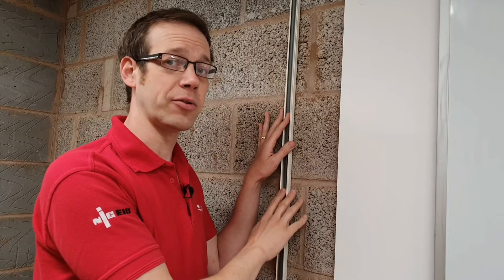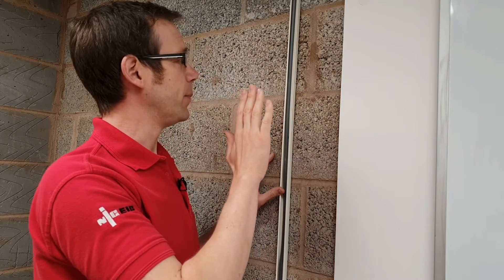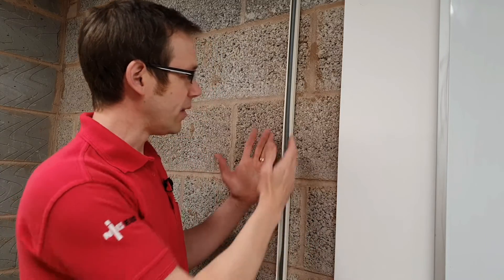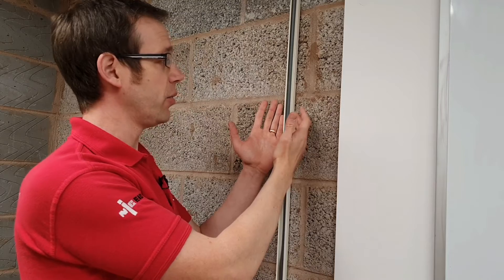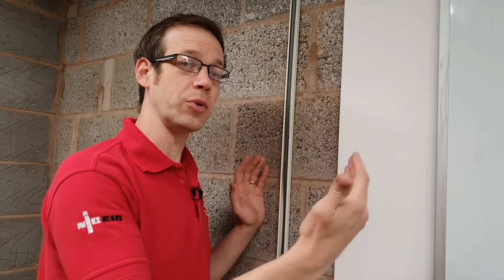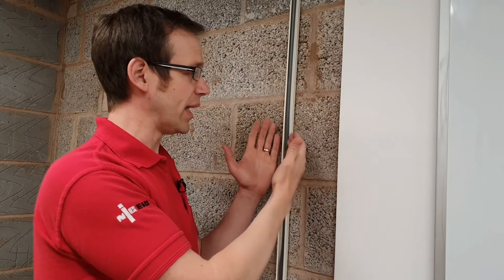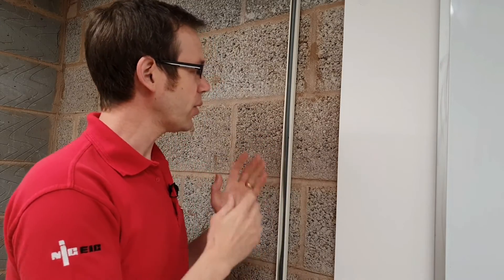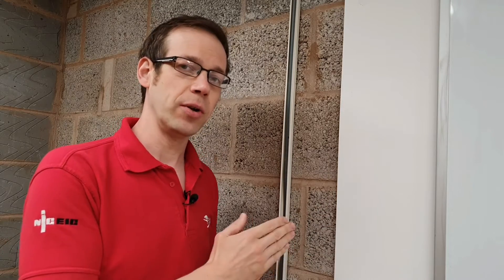We've got the cable nicely installed on the truss above our heads, and now we're looking at how we're going to secure the cable as it comes down the wall in the plastic trunking. Traditionally the trunking would be screwed onto the wall and you'd simply put the lid on — nice, neat, happy days. But if a fire breaks out, the trunking could just flop forward, and this cable would be in a prime position for causing entanglement. Before thinking about the clips and fixings themselves, we want to think about how we're going to attach those to the wall.